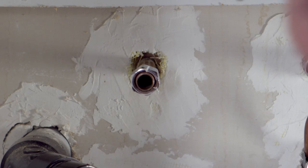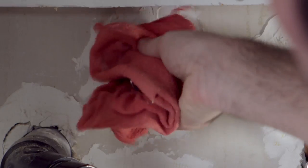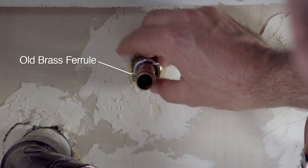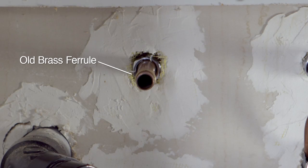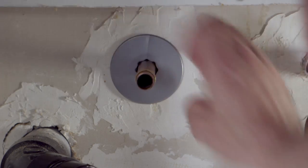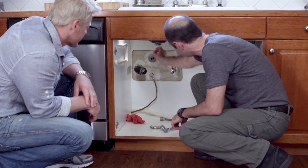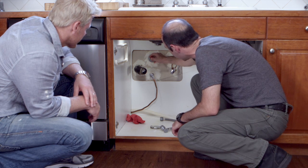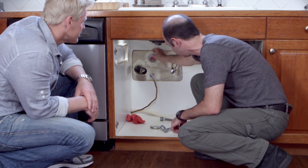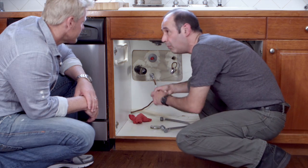Then you want to make sure your pipe is clean with no damage. You're going to push that old nut right back in the wall and take the escutcheon and slide it over the old brass ferrule until it's flush with the wall. Push on the gauge and slide it down until it bottoms out. This indicates that there's enough room on the pipe for a new valve. You want to mark the pipe then.